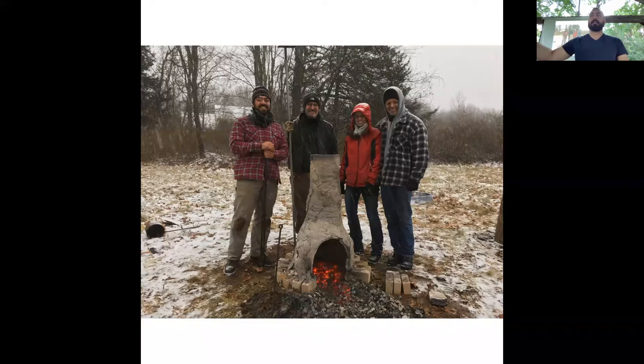Once the furnace is properly hot and we've charged about half of what we want to charge, we'll sometimes double the amount of ore that's going in to speed the furnace up a little. But after 6 hours of this and a really bad snowstorm that I thought was going to totally tank us, this is what you get.